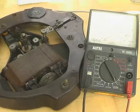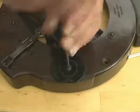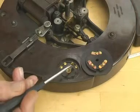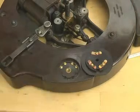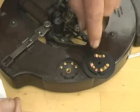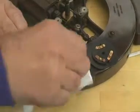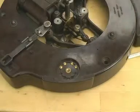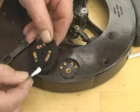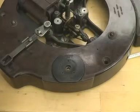Here's the adjuster for the main supply — I just want to see what it's like inside. Those are the ends of the windings, and these shorting strips connect them. The one for mains — 250 volts — joins that one to that one, so it's clearly putting them in series. Nice and clean, no corrosion. We can always polish those up, but I'm quite happy now about putting it on.